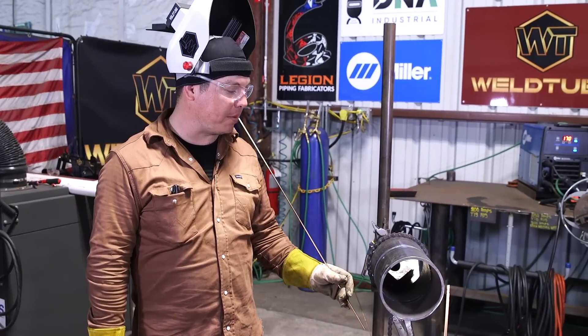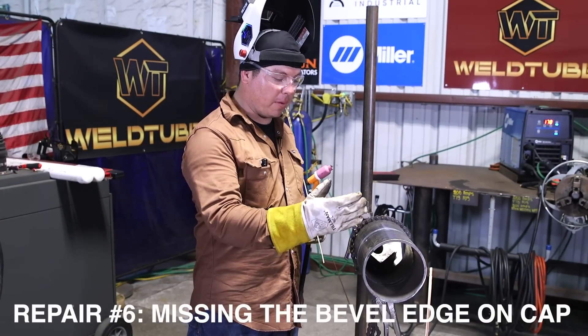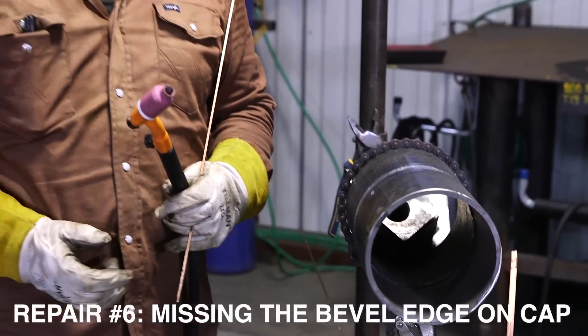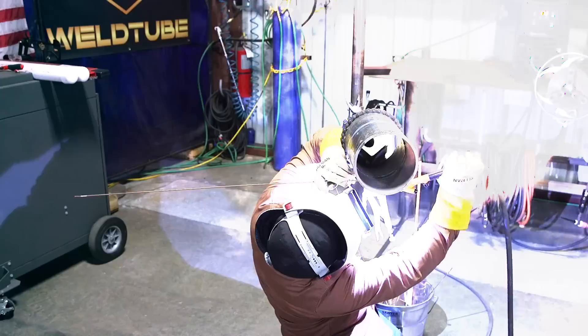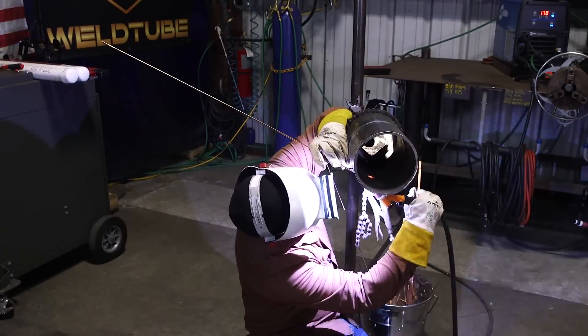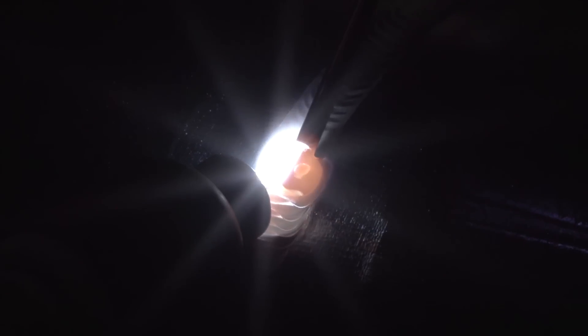We're going to get ready to cap this. Coming up around here, I am going to miss the bevel edges, not completely cover our bevel. That kind of happens when it's just that right time of day - the sun gets in the back of your hood and you can't see where you're going, or you've got obstructions and can't see well. Coming up here, I'm going to go ahead and just kind of veer off my bevels, kind of like if the sun's in the back of our hood. Maybe the pipe was a little too high and our own cup kind of blocks our view.